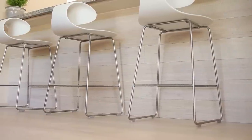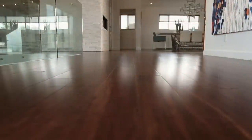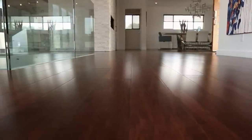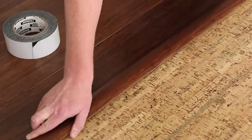For floating floors, we require that no cabinets or other permanent fixtures are installed on top of the floor, and nothing is ever nailed or screwed through the planks. You'll also want to steer clear of furniture over 500 pounds sitting on a floating floor.